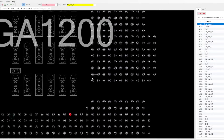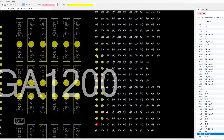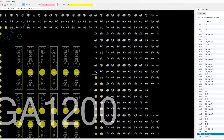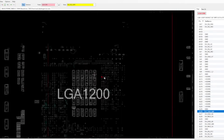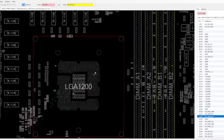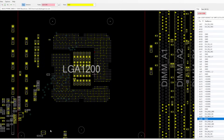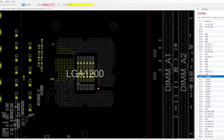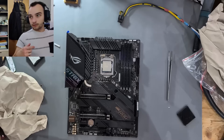Looking at this side: ground, VCORE — a lot of VCORE pins — so that isn't a problem. Further up: ground, B8, and this is also for the right channel. B8 is also for the right one, and B3. So we might have working A1 and A2 but definitely not working B1 and B2. Let me get a CPU in there and we'll test the DDR data channels.